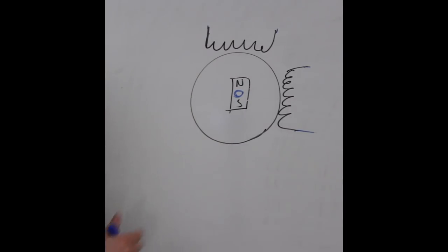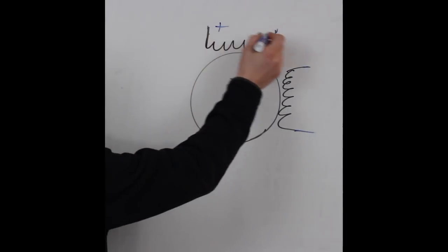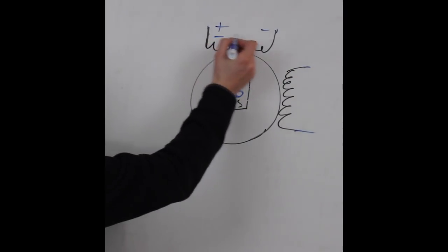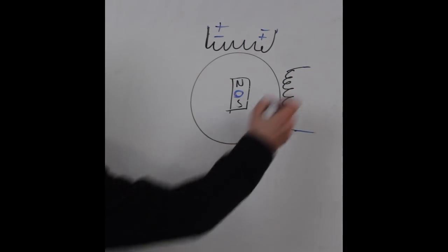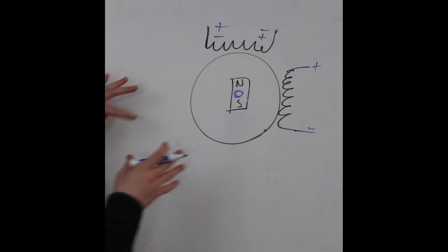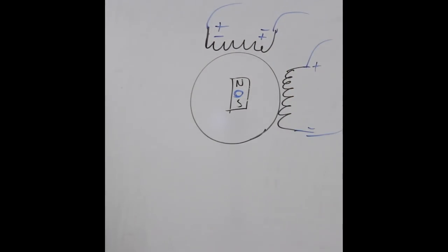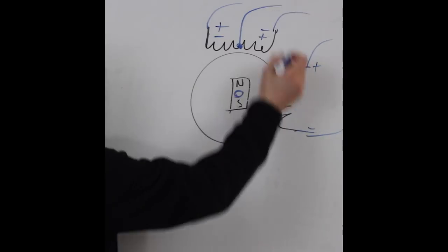What I'm showing here is a bipolar stepper motor. They call it bipolar because you need two polarities to drive these coils — I need to drive this coil either positive-minus or minus-positive, so it's bipolar. You have two sets of coils, and typically bipolar stepper motors have four leads for those two sets of coils.